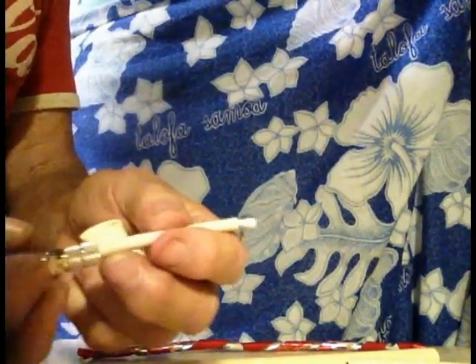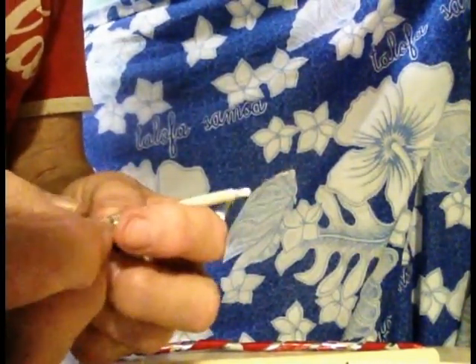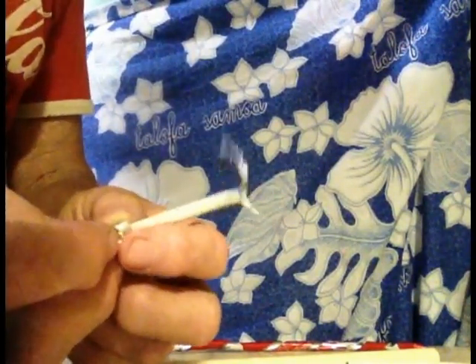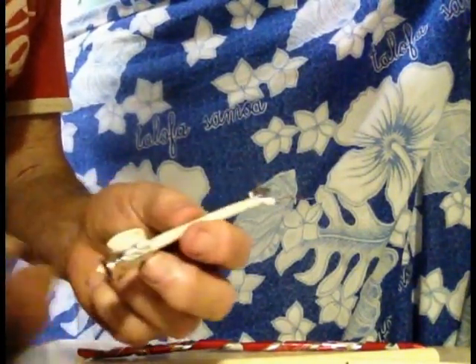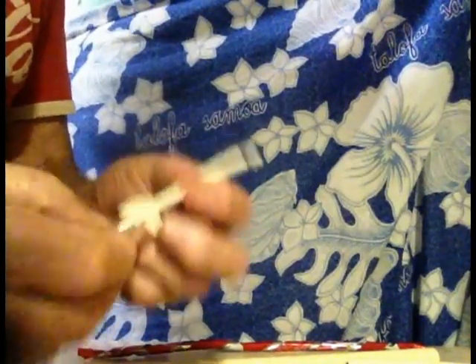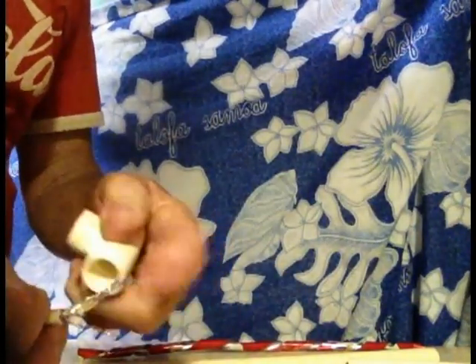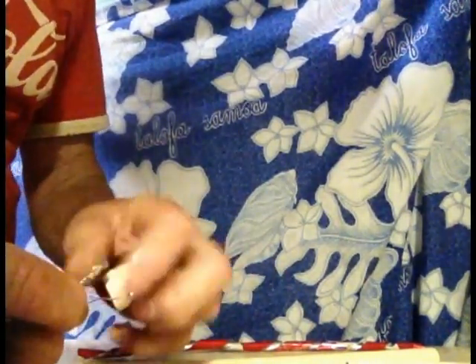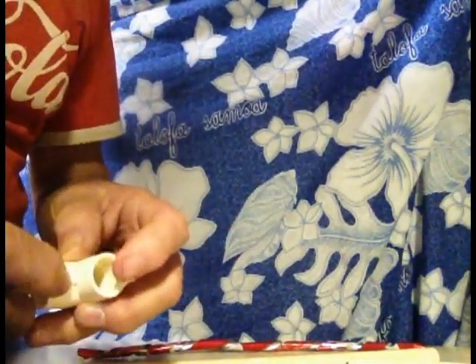This is RG59 cable — just a short length. You can have the whole cable without this connector, giving you a longer cable to reach right from the antenna to your TV set. The advantage of a short piece is it's easier to disconnect the antenna and just leave the feed cable where it is. You can do it either way. Feed the center conductor to one side of the T-connector and the shielding to the other side.